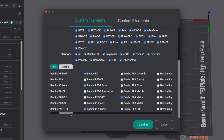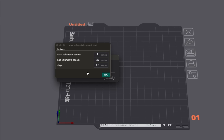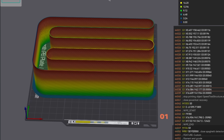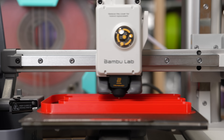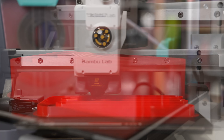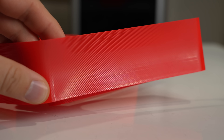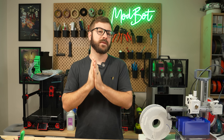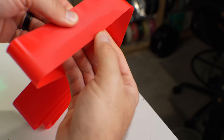At the time of recording there wasn't a separate high-flow profile, and given the data on Bambu's product page, other than bumping speeds it shouldn't require any other changes. The first test I ran was the built-in max flow rate test. I started with basic PETG and ran the racetrack from 8 to 30 cubic millimeters per second with a 0.5 step rate. The gaps I usually watch for never came. Looking at it from the side, we can see a very clear change in material appearance — around 16 to 17 cubic millimeters per second there's a sharp transition from a glossy exterior to completely matte, indicating the filament isn't getting as hot before being extruded.